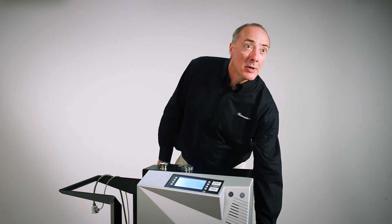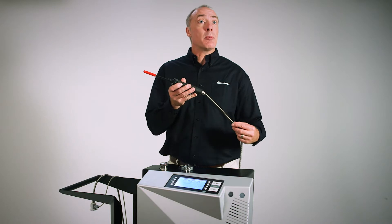In this video I'm going to show you how to use the Edwards ELD500 in atmospheric sniffer mode. The atmospheric sniffer probe can be used to test the system pressurized with a gas containing helium. The sniffer probe works by drawing a sample of air into the ELD500 via a long flexible pipe. At the end of the pipe is a wand that can be moved around the piece under test.